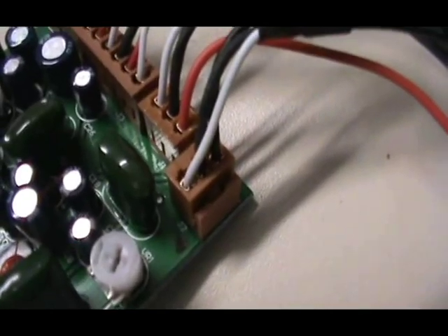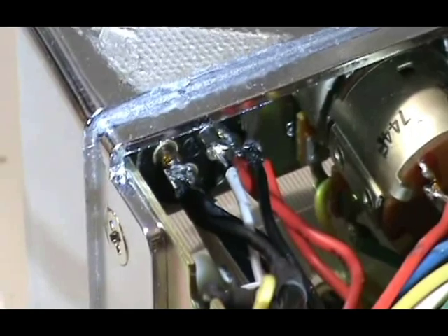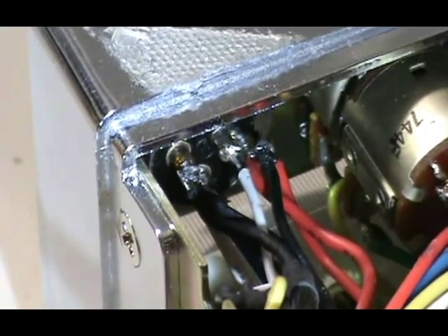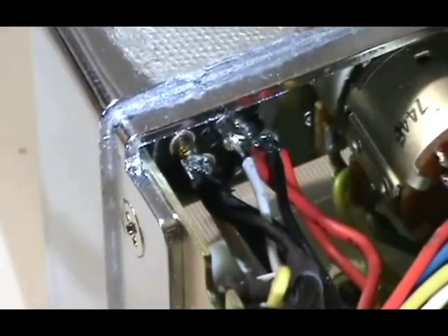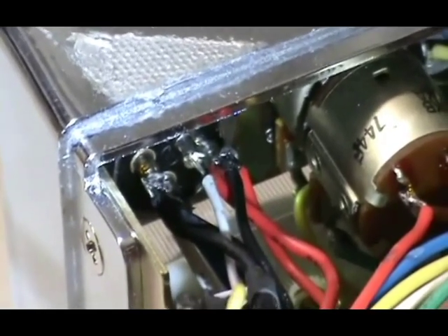Go to pin number one and attach the black wire from J4, the middle black wire from J1, and the middle black wire from J2. On the left-hand side, that's pin number one — the ground — and you can see the three black wires attached there. Pin number two, the audio pin, has the white wire attached. On the right-hand side, the transmit wire is red and we've attached two wires to pin number three. Nothing goes to pin four with the echo board. The black wire in the third position from J2 and the red wire from J1 both go to pin number three.